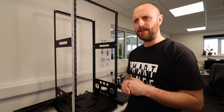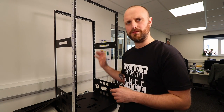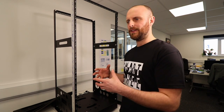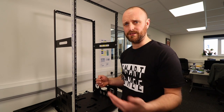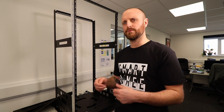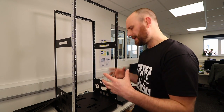Things like where the power is located for the rack — a lot of people like to put 16 double gang sockets on the wall. Work out what your power requirement is for that rack, add 50% to it, and then get a double gang 13-amp ring socket put in place, because you can always add sockets to that in the future. We like to have a specific breaker for our rack, so if it trips we know it's something to do specifically with our rack, or if the house trips it's not going to necessarily take away the rack and that functionality.